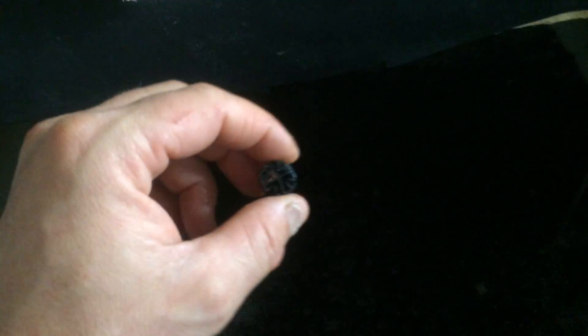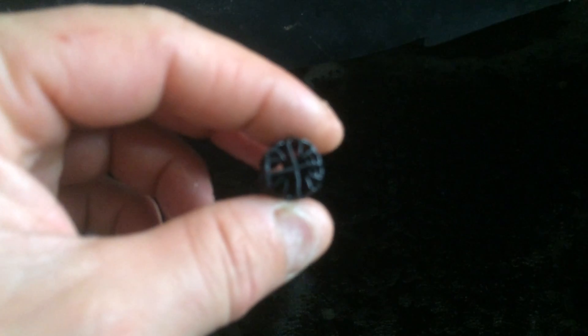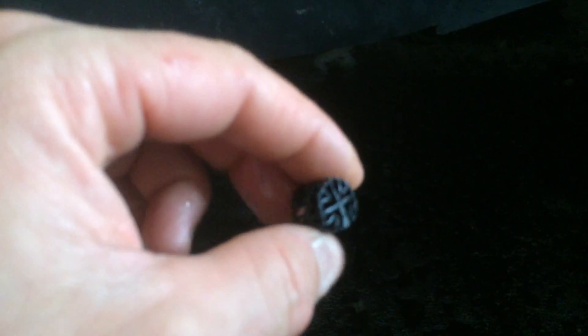Water is taken through this pipe down here into the biofilter with moving bed bio media. This is the best quality media. We have 750 square metres per cubic metre — so 750 square metres per 1,000 litres per cubic metre. I'll post those numbers for you. So in here I have about 600 litres which gives me quite a good amount of surface area.